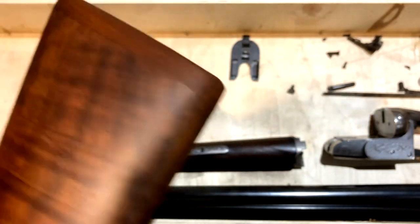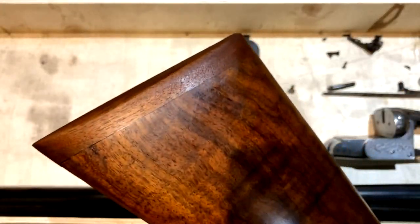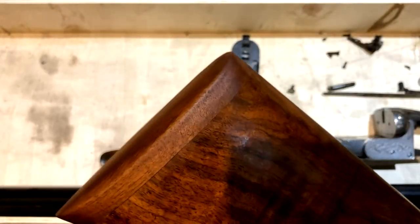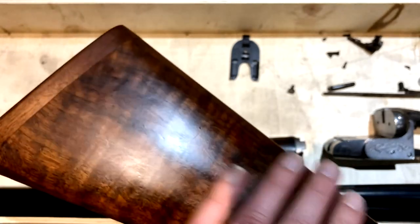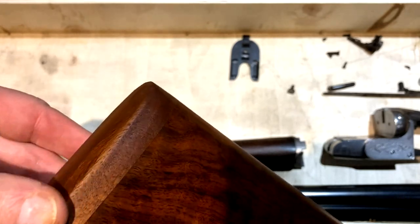I get a little bit of sealer and very quickly put a bit of a coat on it. This is just as a grain reliever. I'll fill the grain. And I can see where I need to sand in a finer grit or use wire wool. I'm slightly ahead of the process on this particular occasion. But you can see that it does start to shape up. Obviously, that's not been checkered yet. Just a little progress report to see how it improves with time.